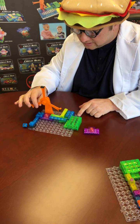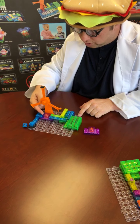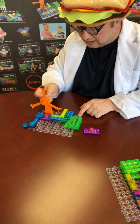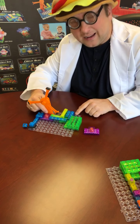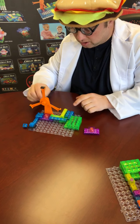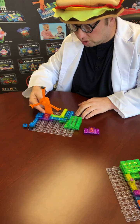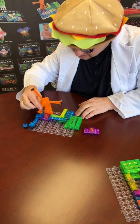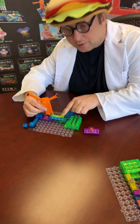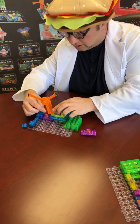So what that means is that the only way that this transistor is on and letting current flow through the inductor to create a magnetic field is when there's current going into the base, and that only happens when the magnet is near the inductor module. Because when it's away from it, there's no magnetic field here. No current into the base, no current through the inductor, no magnetic field. But as this comes down, the magnet turns on the reed switch. That puts current into the base of the transistor, turning it on, letting current flow through the inductor, and creates the magnetic field.